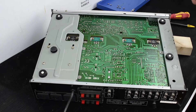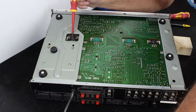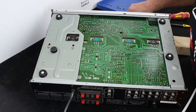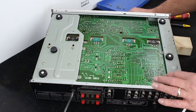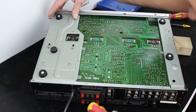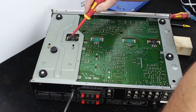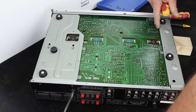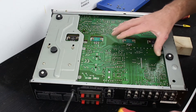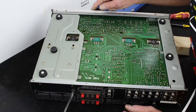As you can see, there are a number of power amplifiers for channels one, two, three, and four mounted onto the heat sink, so this board and the heat sink are all one unit. The transformer is under here. Looking at the board, it goes around here and around here, so all the components and soldered connections underneath this board are accessible with this plate off — I don't need to dismantle the whole unit.